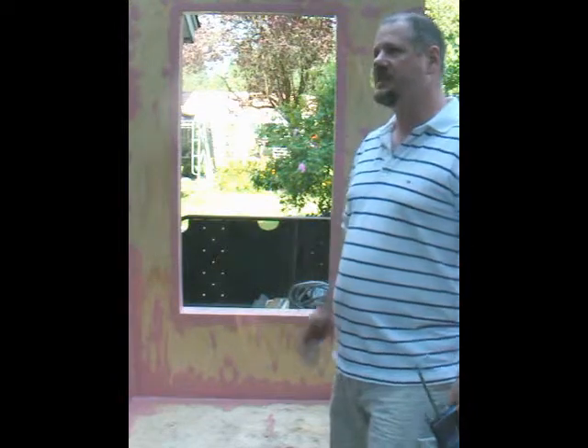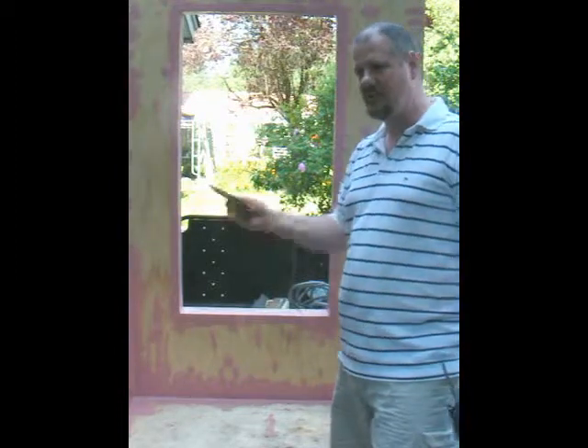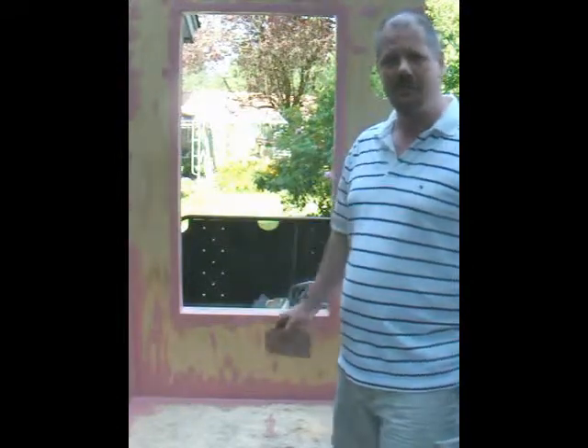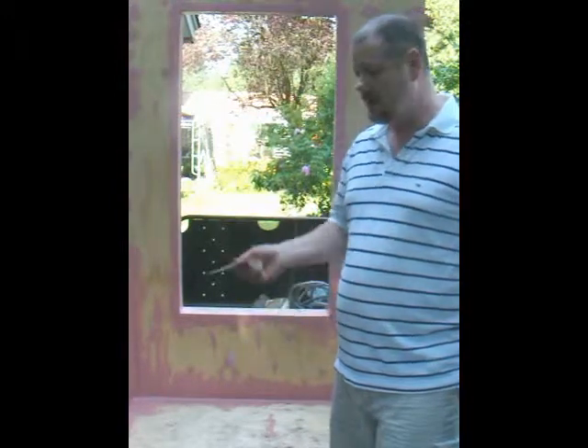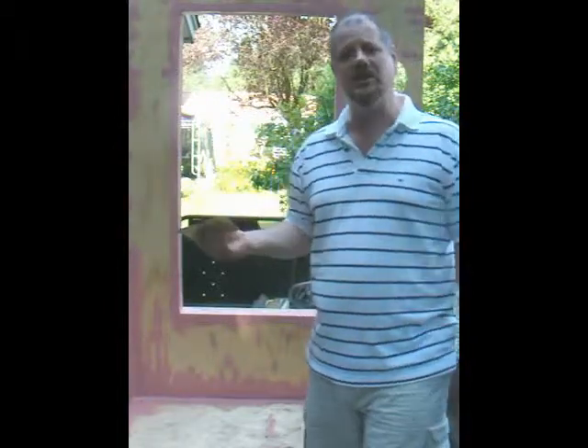So if you're on a job site and your electrician might have forgotten to put in the rough openings for the electrical nipples and has to do so later, it's a matter of drilling the hole through, setting the right profile depth out from the sheathing, and you can then seal it up at any time. As long as it's accessible, you can seal it up and you don't have to worry about back-lapping with the other products that were already installed, like you would on a sheeting material.